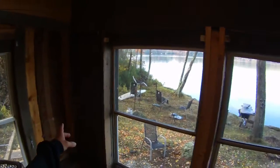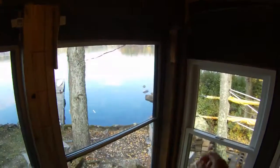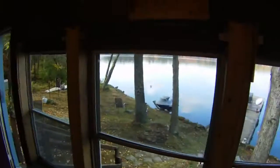So I'm going to be adding a post in each one of these corners. I'm going to have a laminate beam going up here, and basically again they did not put any kind of 2x10 here, so we're definitely going to add a laminate beam here. We're going to be putting a post in each one of these corners.